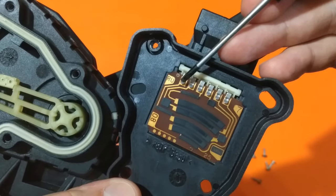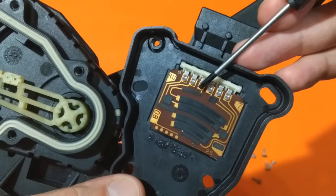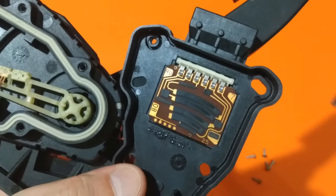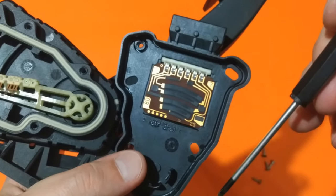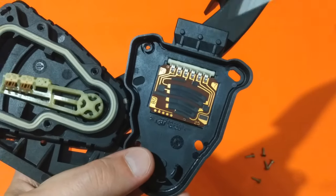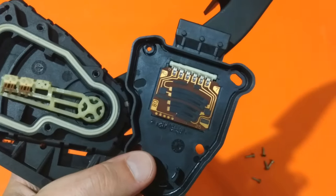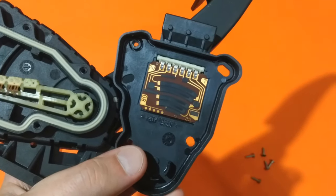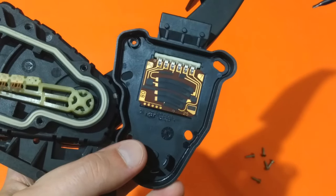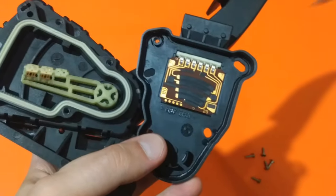The pinout of the circuit board is as follows: first 5-volt power source, second 5-volt power source, signal wire of the first potentiometer, first ground, second ground, signal wire of the second potentiometer. In most cases like this one, the second potentiometer gives two times the value of the first — so if we read 1.5 volts on the first, we should read 3 volts on the second, plus or minus 50 millivolts.